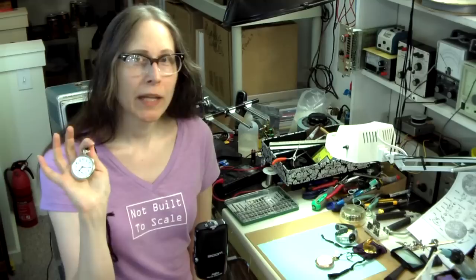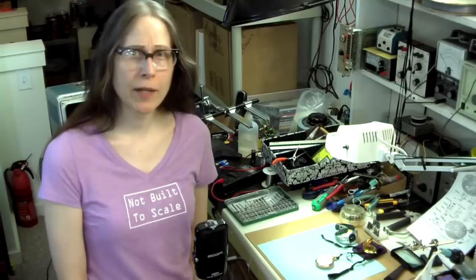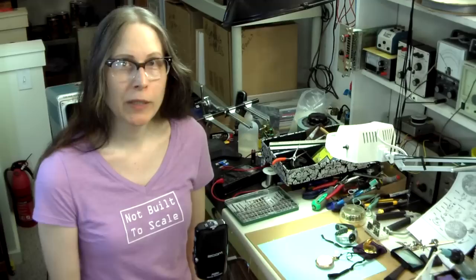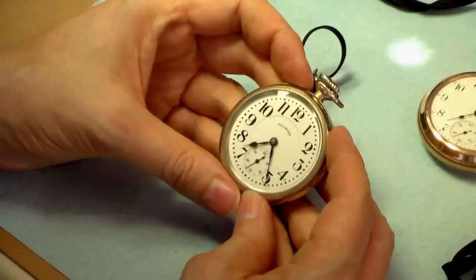My 1928 Illinois — I recently had it serviced and cleaned, which you need to do about every five, six, seven years or so. As they start to get a little slow, you have to get them cleaned out, get the jewels cleaned, get the balance checked and all that by a competent horologist. I got it back, I've had it in my pocket for a few weeks and it's running a little too fast. So I need to regulate it down just a smidge. I'm doing this vlog not only to show you the watches, but to show you how to regulate them and how to set them.